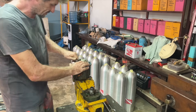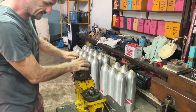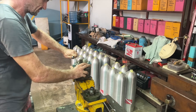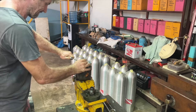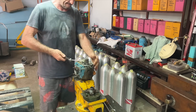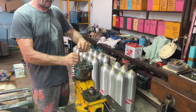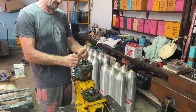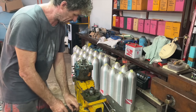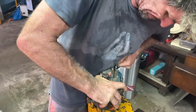After you've got that cap off, there's one really important bolt in there - it's really really tight. I think it's self-tightening as the gearbox is turning. It's bolted through into the shaft with a big tapered countersunk washer - very important. Take care of that one. You feel like you're going to snap the allen wrench on it for sure, but it does pop eventually. No loctite or anything on it - it self-tightens somehow through that tapered washer - it's very very tight.